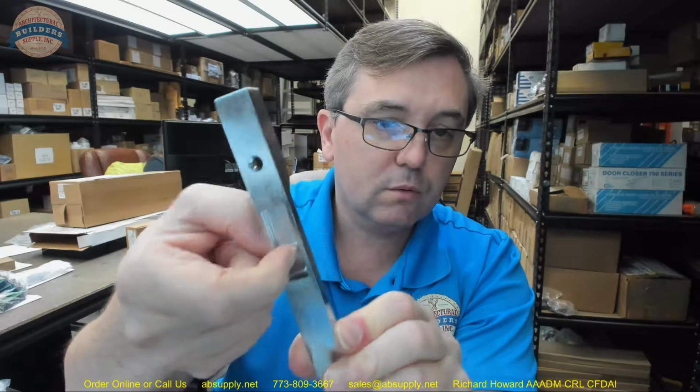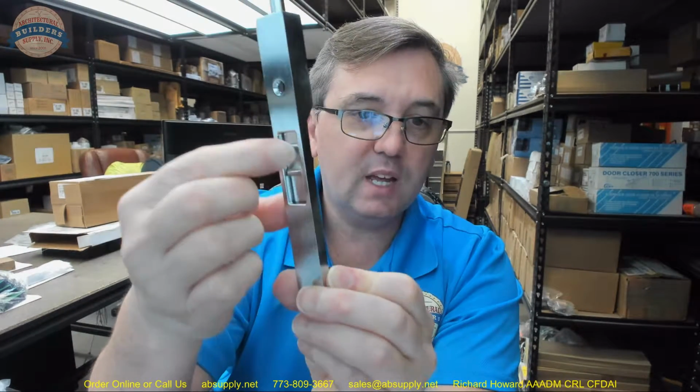Of course, going to be installed in residential doors, top and bottom sort of preparation. Your trigger or your slide. So good operation of this is to push it in and slide it up, and it will lock in place in both positions. Most importantly, locking in the locked position. Okay, very simple mechanism. Mortising this is going to prove to be very simple and straightforward as well.